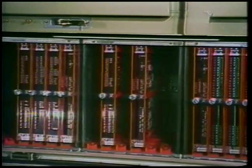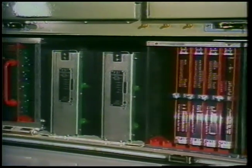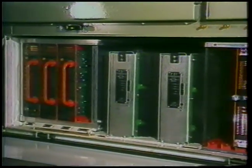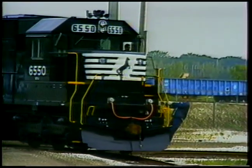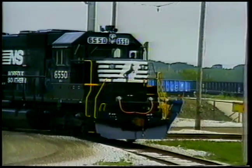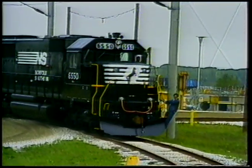The third computer is for a diagnostic and display system, which acts like a troubleshooter by keeping an ongoing audit of the engine's performance, detecting any abnormalities, and sometimes initiating corrective action. This computer is valuable in pinpointing problems for maintenance mechanics, saving time and expense.